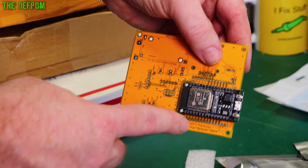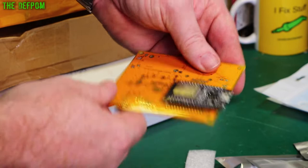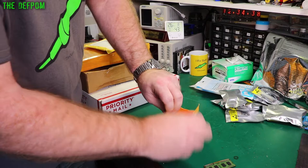I use a female header so you can actually unplug them. Because sometimes when you're using certain pin combinations as outputs, it can interfere with programming the device, or even boot up — sometimes you get some weird issues when it's restarting to do a program. So I always use a female header to plug them in. The sort of thing I use them for is little projects like this — you can just program it, drop it onto a board and off you go. Links for most of these are down below.